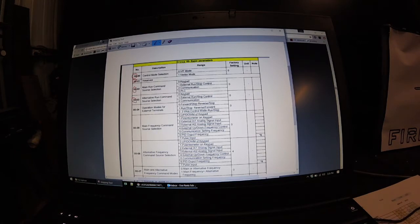If you go into 00-00, that gives you the control mode, which is a choice between variable frequency mode — your standard mode — and vector mode, which is one of the reasons I went for these variable speed drives. Within this menu you'll either have a 0 or a 1. If you have a 0, it represents you're in variable frequency mode. If you have a 1, it represents you're in vector mode.